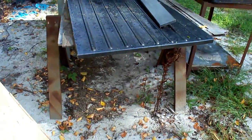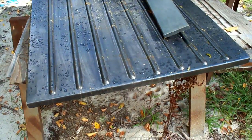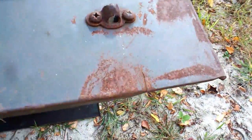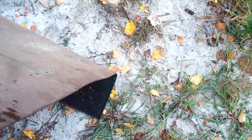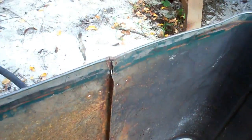I'm going to get it sandblasted — I can't film during the sandblasting — and then probably next time you see me we'll be back in the shop. I'm going to get some epoxy primer on the floor and the other parts. The hood I'm going to leave bare because we've got some shrinking to do on that and we can't have paint on it. It's a decent hood; it's got your usual tears, wrinkles, and buckles, but I'll show you how we bring it back into good shape.